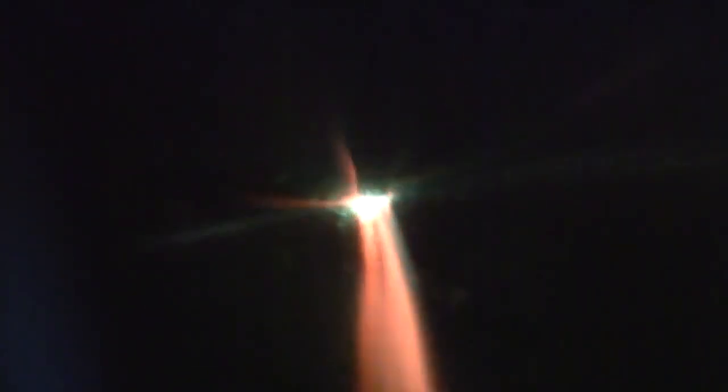Then you're pretty much ready to start cutting stuff. That's our nice adjusted flame right there. What we're going to do is come and put the flame right on top of the metal we want to cut. If it's an edge, put about half the flame over the edge and half not over the edge. Pretty much immediately you'll start to see stuff glowing — most of that's just rust. Give a quick little tap of the cutting lever — wait, it's ready to cut already, I took too long to say that.